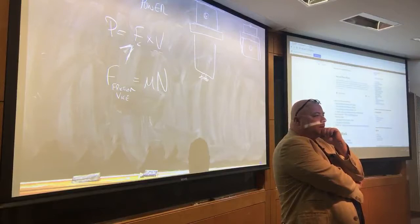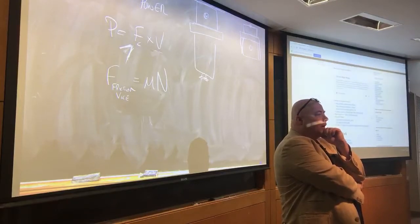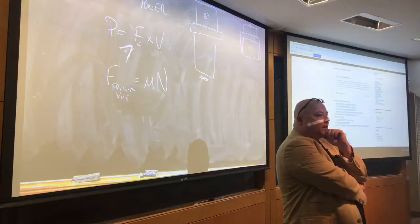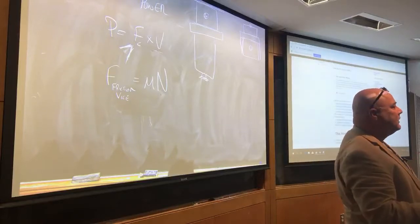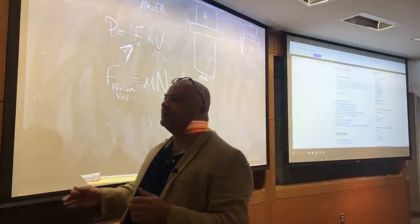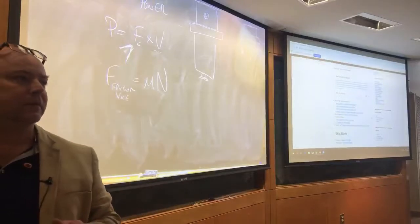I've never done the math. I believe there is math that would let me figure it out. I've always just tried. And you try by backing off the clamping force sometimes. You try by changing the shape a little bit, maybe, if you're trying to get a circle, make a little bit of an oval. Yeah, okay, but we can all do this, right?